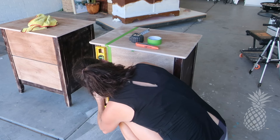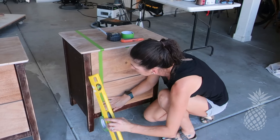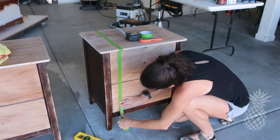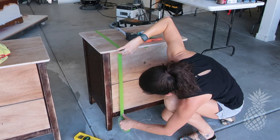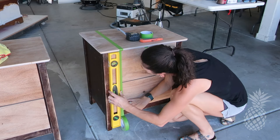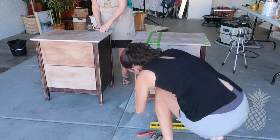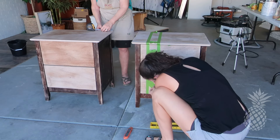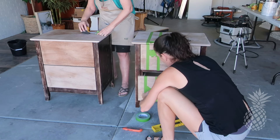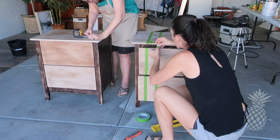We're going to be adding stripes to these nightstands on the top and on the fronts of the drawers. This is a tedious process — you really have to make sure it's symmetrical, the left nightstand versus the right nightstand, and you need to make sure they're perfectly spaced apart and completely straight and level all the way down. This process took us about 20 to 30 minutes just to get two lines of tape for our first stripe. For our stripes, we wanted one wide black stripe in the middle and a narrow white stripe on each side of that. We started out with the wide stripe and made that two tape widths wide, using two pieces of tape on the top and bottom and then using that as our guide for our second piece of tape.